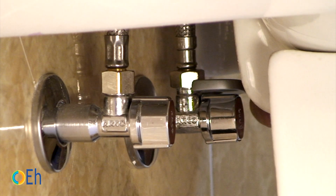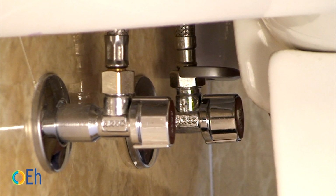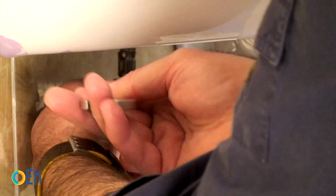The first thing is to cut off the water supply from the stopcock. To start dismantling things, we're going to release the hydraulic hoses. We have emptied the tap, but for caution, in your house, when you do this procedure, put a bucket under it, because inside the hoses there is water.